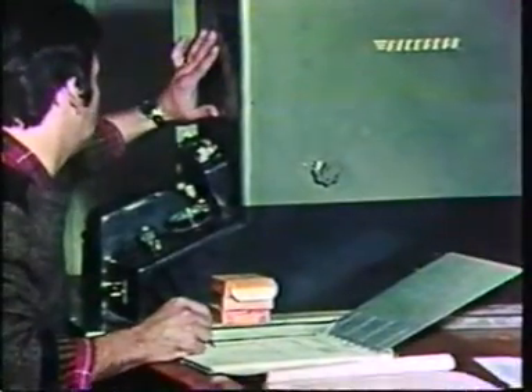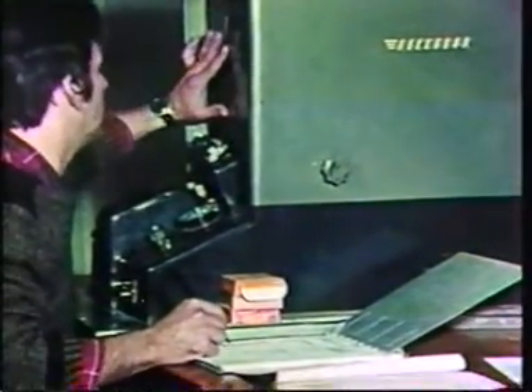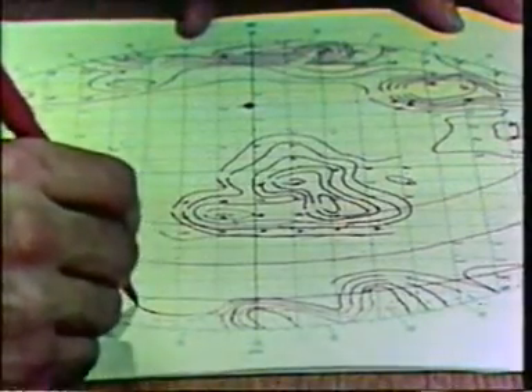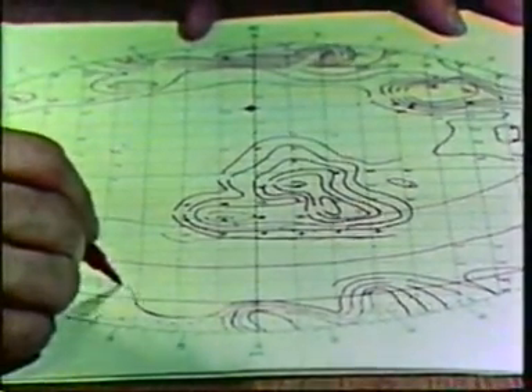The information is transcribed on an angle plotter and calculations have to be made to compensate for the angle of dip and the strike of the beds in the borehole. The orientation of the camera has to be carefully noted, and the series of corrections eventually allow the data to be plotted.